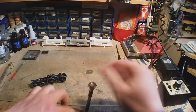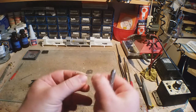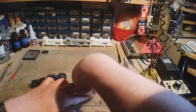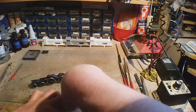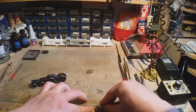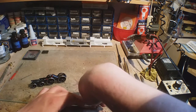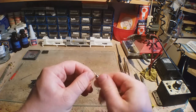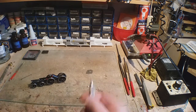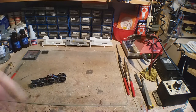If you do it in the wood, you can feel when you're in. What I've done is, rather than going for the drill size that's 1.5mm, you go for a bit smaller and you just build up. If you want, you can use those taper broaches as well. It's been awkward to come out.